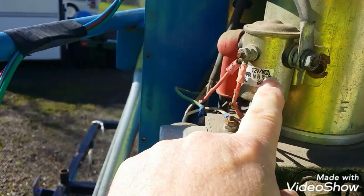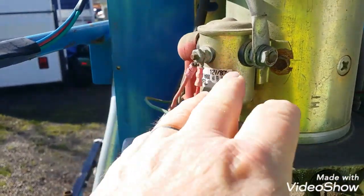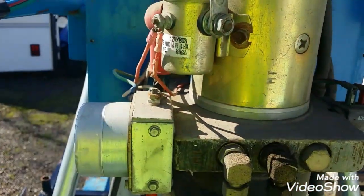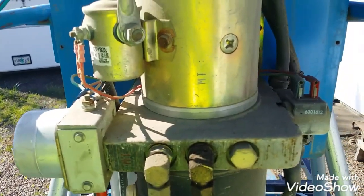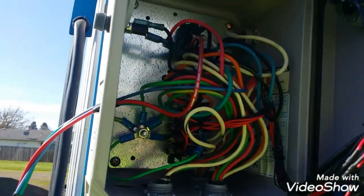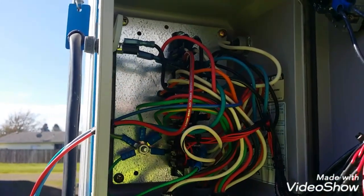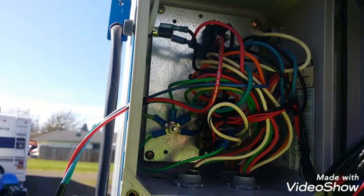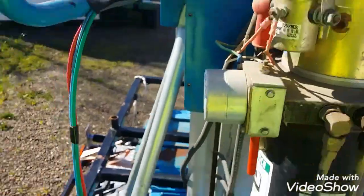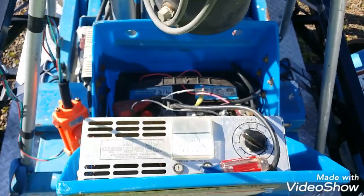This is an 80%, which is fine. I'm sure it has a rating around 100-150 amps, which should be plenty to run this pump. I'm going to start digging and pulling wires. I looked online for a schematic — it was unsuccessful. But these things aren't that complicated. I might have to get a tablet and pencil out, make some notes, see what goes where, and then we'll figure out how to bypass these four corner limit switches, which were really plaguing me last year.